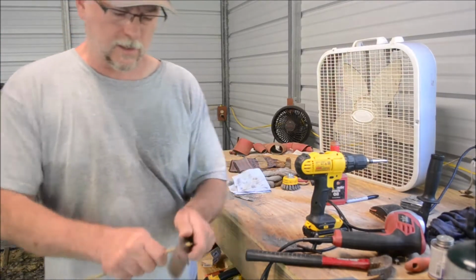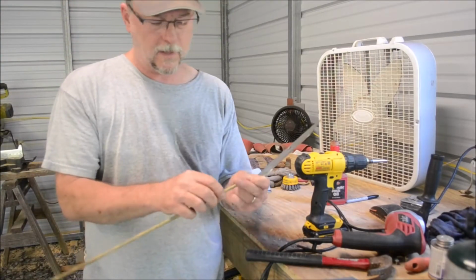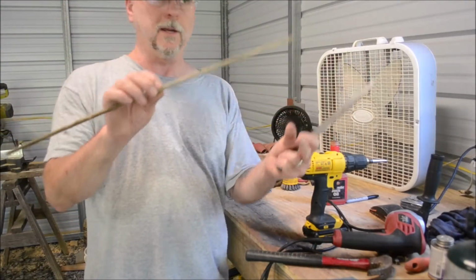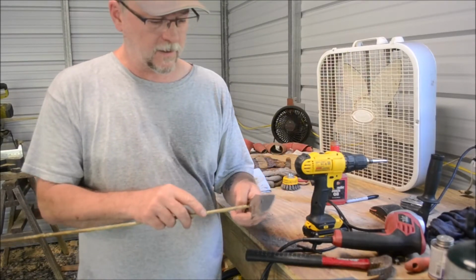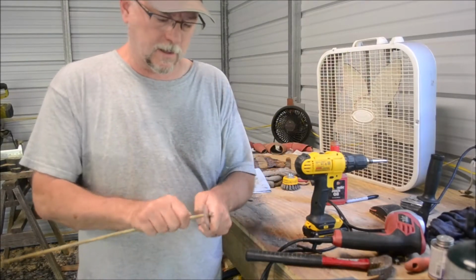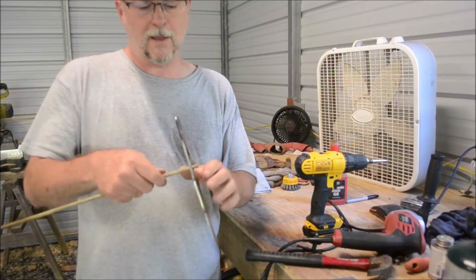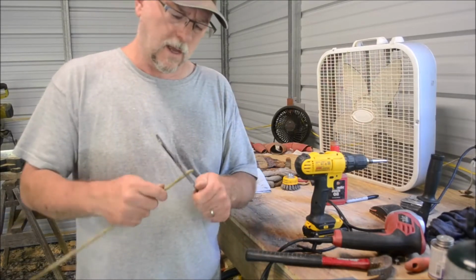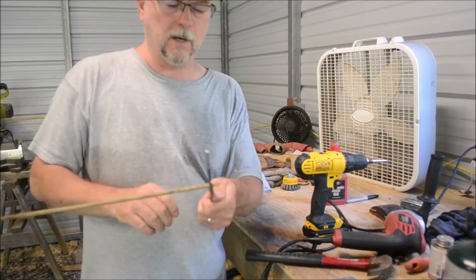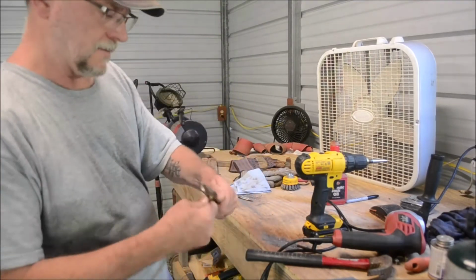Accomplish with that is to get these holes where this is just a press fit in there. This is just an old piece of dowel that I found laying out here in my pile of stuff. And when you put that in there, it's definitely a press fit. I may have to even drill it out just slightly larger. I actually got that pretty sharp right now. I may have to drill it out slightly larger, but I'll try to put it in there with a rubber mallet when I get the scales made.